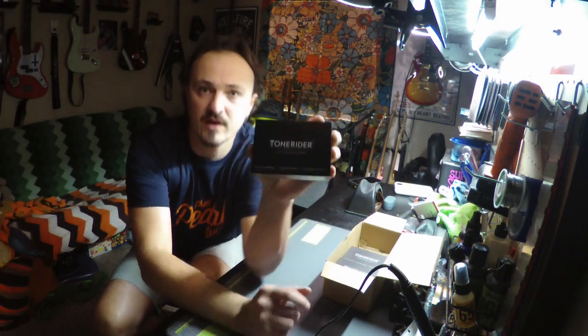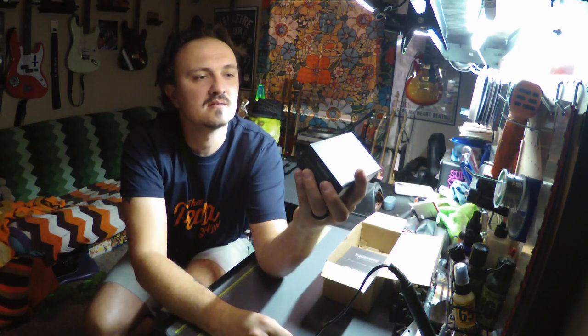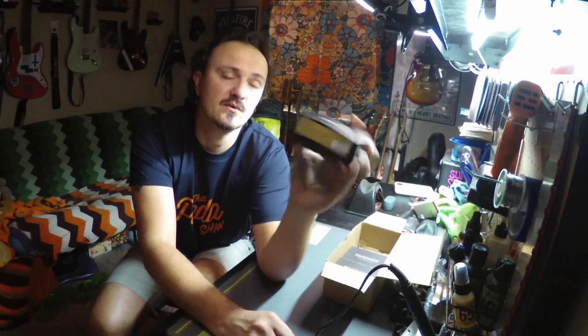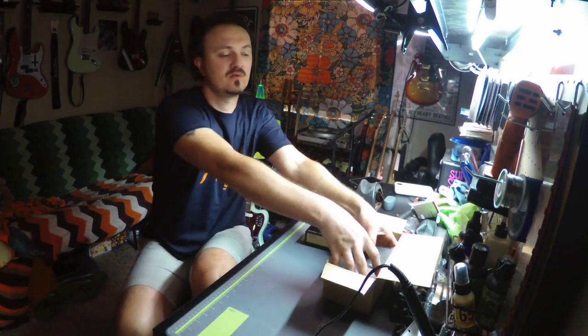So I bought from Tone Rider the Classic P Vintage Voiced Pickup Set for Precision Basses, directly inspired by instruments from the 50s, scatter wound for harmonic complexity. It says that I should get a reading of 10.6K resistance reading. And these are Alnico 5. So, that is these.